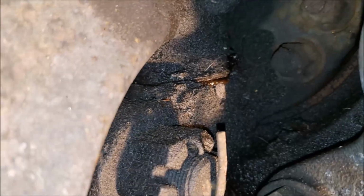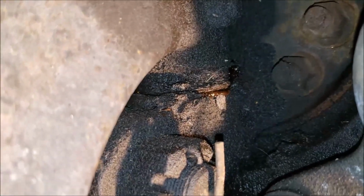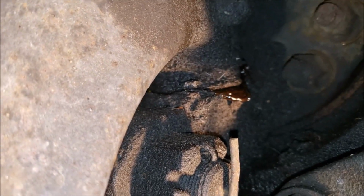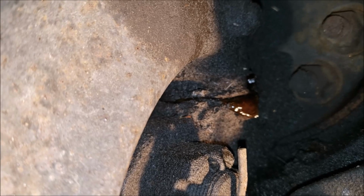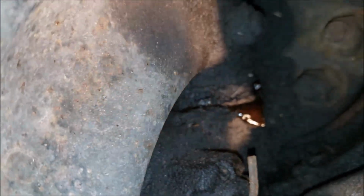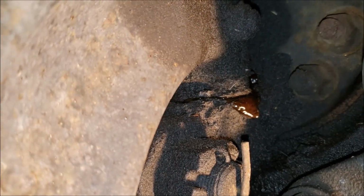Remember how I talked about lifting the wheels off the ground, and you can see the grease is coming out the bottom part of the thrust bearing. And I don't know if it would still do that if it had all the weight on it. So that works out really good. Actually, I've seen it rotate. When I put grease in there first, I saw the bearing rotate just a little bit as it was coming through.